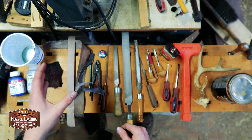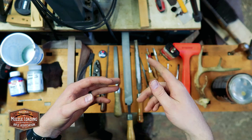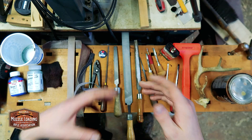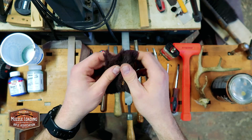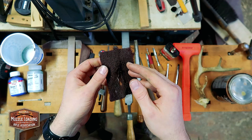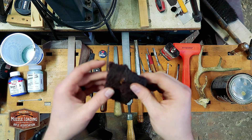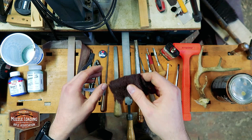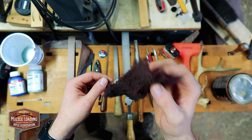On top of sandpaper, you'll see I'm going to use a buffing wheel with some buffing compound a little bit — that's by no means something you have to do. If you don't have a buffing wheel, I recommend getting a fabric wheel and hooking it onto a power drill and using the buffing compound just as I'm going to do on the stationary buffing wheel to get a uniform look. As a finish to any sanding and polishing, I'm using just a piece of Scotch-Brite. There are a ton of colors out on the market. This is what I consider a magic tool — it can take a part you're worried about and really polish it up nice without a lot of effort. So from 180 grit to 240 to 400 and then Scotch-Brite — this is going to be plenty and will make it easy to get a nice finish.